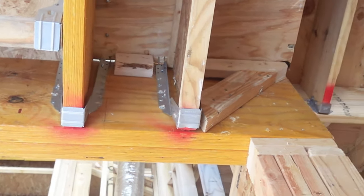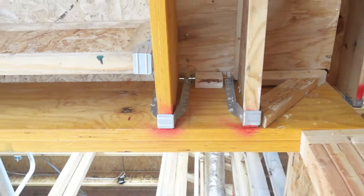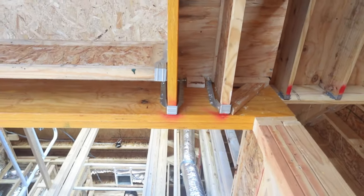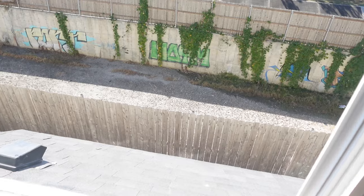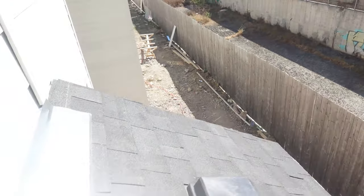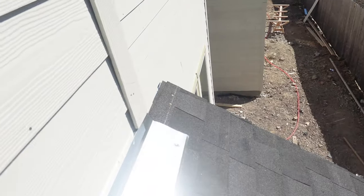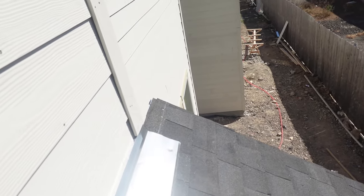Looking out this window at the roof structure — on this left side there's actually a piece of flashing missing, and this mechanical exhaust termination right here is lifted up a little bit, so it definitely needs to be re-secured.